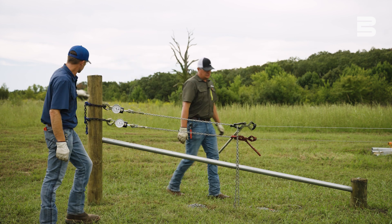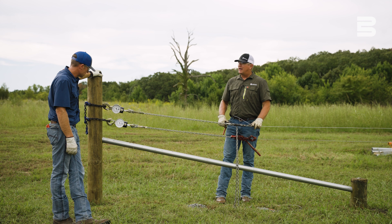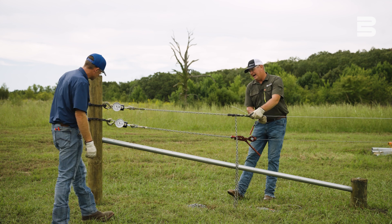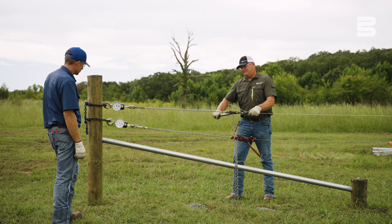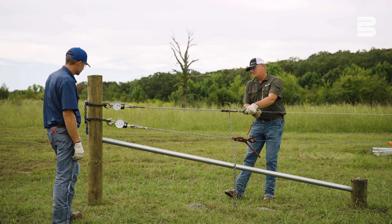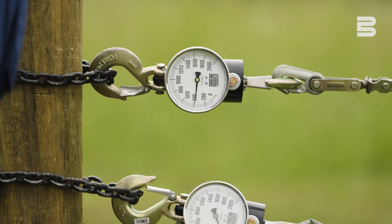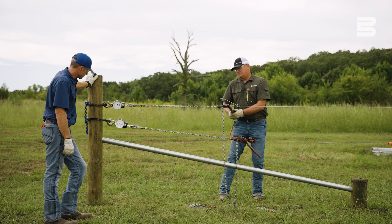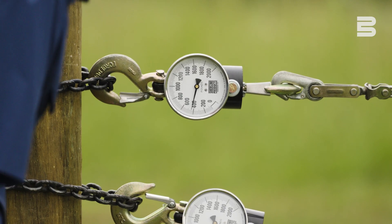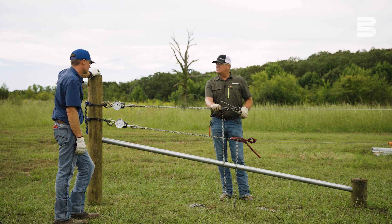Let's just work on this low carbon first. We know where this product is going to break, and this gauge is just going to show us how it reacts to a load. All right, you just crossed 200 — you're probably 240 pounds. Now you're at just shy of 400. Let's go just a little bit more. Just over 400, probably 440. Now I just took a full rotation, so that may mean that this fence is already stretching.